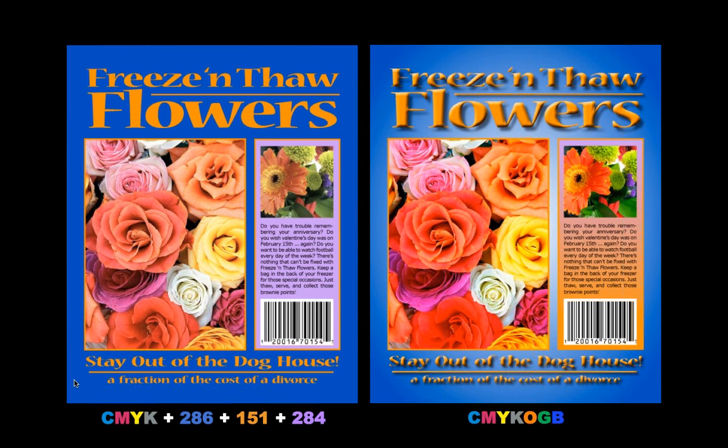Well, you know, there's a couple areas where depth comes from. So one of them you could say is, how dark are the colors that you can print? And you can print just as dark of colors with expanded gamut as you can by using a spot color. But compared to spot colors, you might lose a little bit of chroma, right? So in terms of lightness and darkness, which is one contributor to depth, we can get the same depth from expanded gamut.